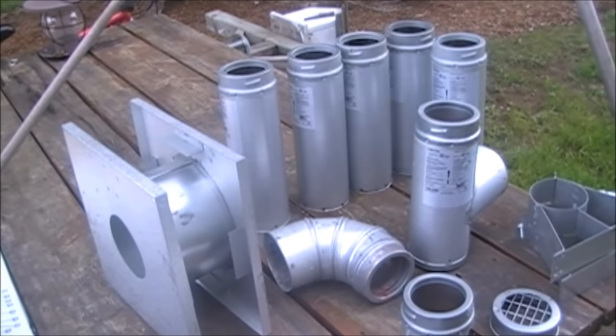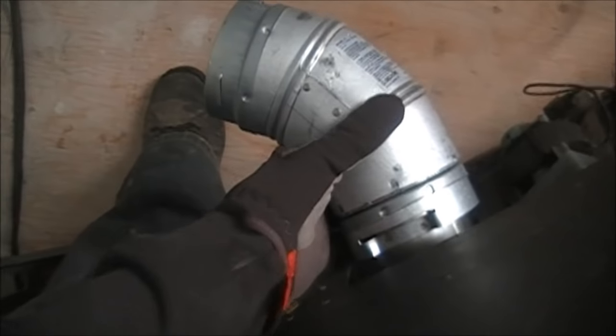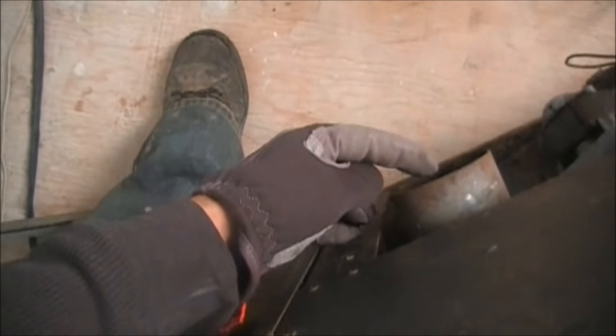So I will start getting stuff lined up inside. I got to use this 45-degree elbow — it's actually meant to go on the outside to give it a bit more of a downturn, but because of the way I'm mounting it in here I needed the 45 inside. So what I did was I measured from the floor up to the center of this pipe — that was 16 inches. I measured up exactly where this is going to come in and meet the wall, marked 16 inches up from the ground, then measured 5 inches each way, took a level, and made it a box — 10 inches by 10 inches. That's the size you need for the plate.